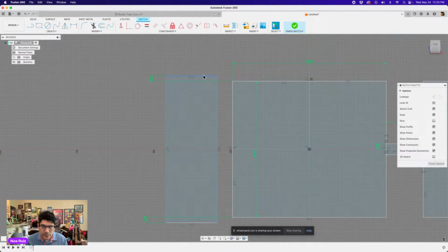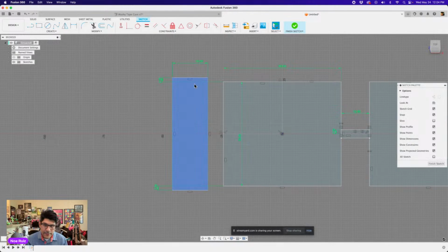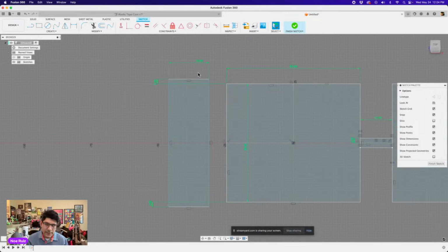And then I'm going to create the length of this needs to be the thickness of our case. So it's going to be 12 plus a 1. It's going to be 12 millimeters thick of the case, right? Plus 1 millimeter of wall thickness plus 2 millimeters of distance, that is our length. So it's really going to be 15 millimeters. But it's important to break it out so that you know that your case is 12 millimeters thick. You're going to have 1 millimeter of wall thickness that you need to offset, and then 2 millimeters of distance for our live hinge. So that is the formula that we create for the length of our top cover, because it's going to be printing upright. So we need to do it that way.